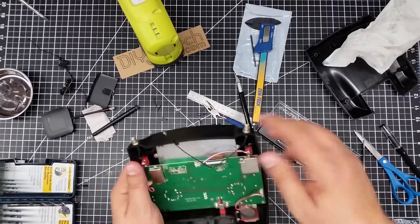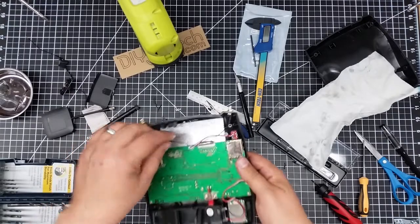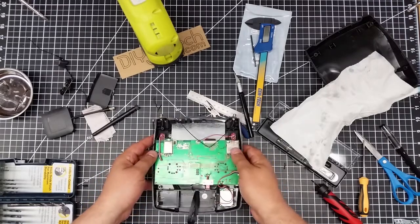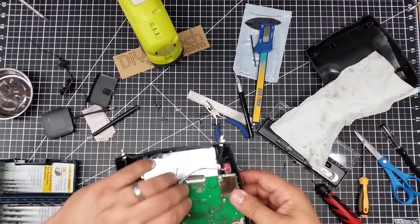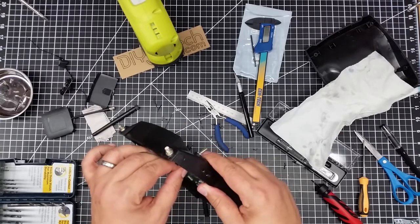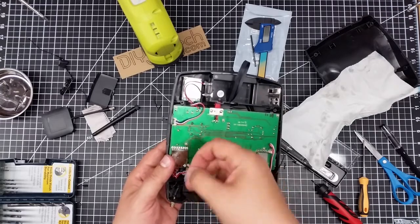I cleaned up a bit of that off the threads above it and that should be okay. Now, the other thing I want to mention is be careful with the downward force you put on the switches and stuff. I had to be kind of careful as I was pressing and cutting during that whole procedure. So now we're going to put the micro SMA connectors on here — these are pretty straightforward. You should hear a pop when they go on, or else they're not on properly.